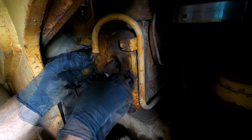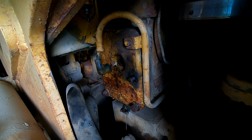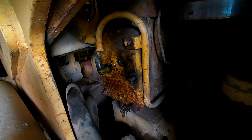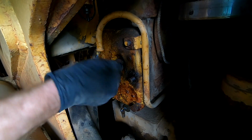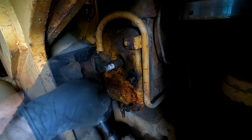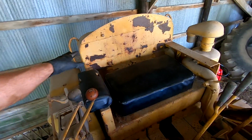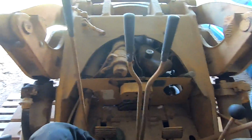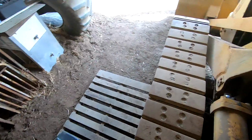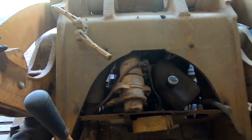Pop these plugs back in there. Actually, before we do that, let's throw a little oil in there. A little oil. A little ether. Little spark plug. All right, so because I have to sit on it, I took some time, I wiped the seat cushion clean, the armrest clean, the one that's here anyway, and yeah, better than nothing. All right, let's try this. Let's take this cover off the pony motor's exhaust. Got some oil and starting fluid in each cylinder.